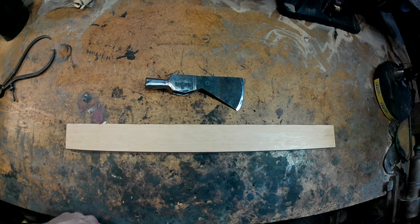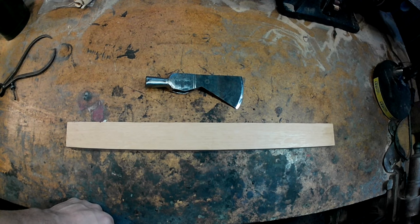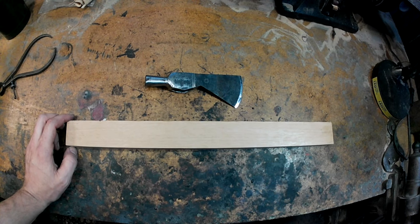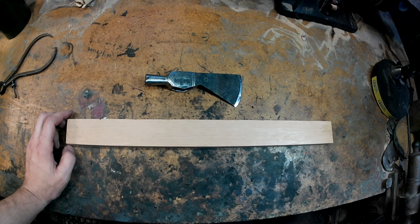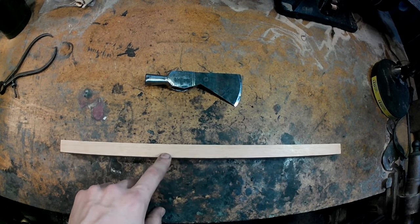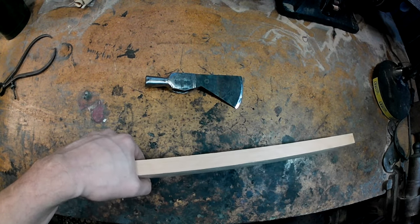As far as length, historically they're all over the place — you'll see them as short as 10 inches, which is rather stubby, and I've seen belt axe and tomahawk handles all the way out to 25 inches, which is a bit excessive. I find a good usable length to be between 15 and 18 inches. This particular one is just under 18. On the width it's about one and three-quarters, and on the thickness — pay close attention — I have mine at about three-quarters of an inch. Too thick in cross section becomes uncomfortable to hold.